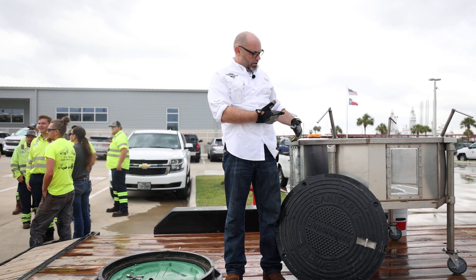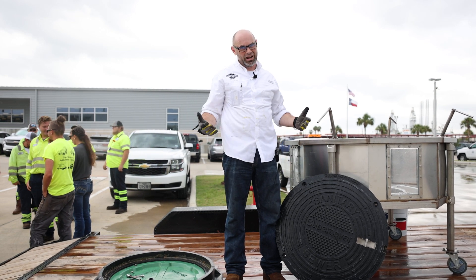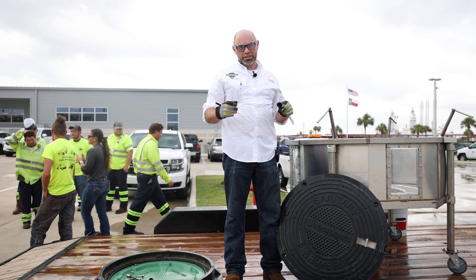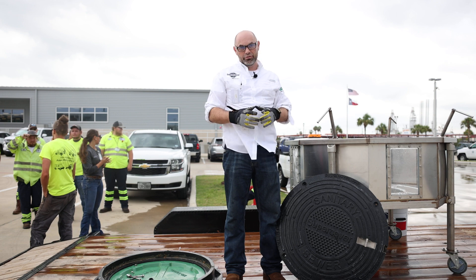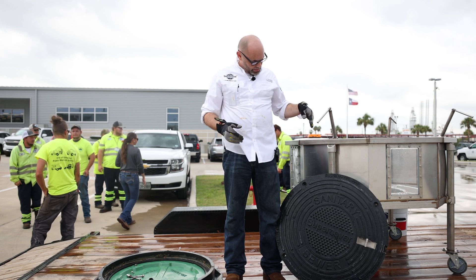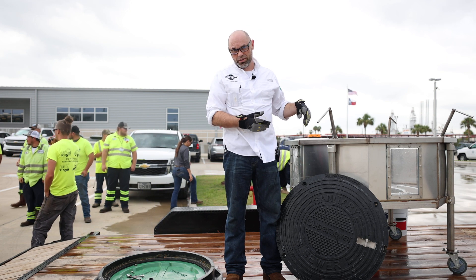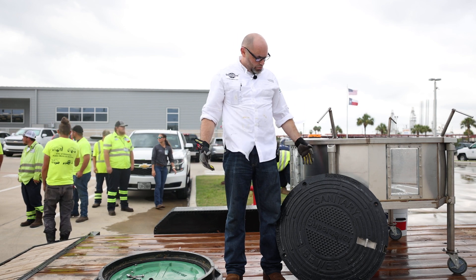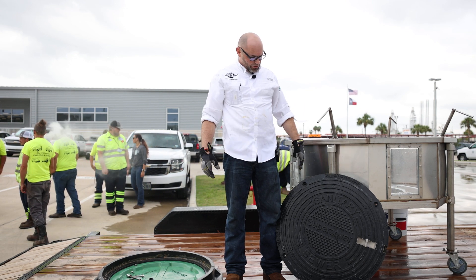As you can see, we concluded our water box test. We had a little bit more than 60 gallons — approximately 60 gallons per minute — with the standard cast iron vented manhole cover. When we tested the SuperCover with and without bolts, we're getting zero GPM. So that concludes our test.